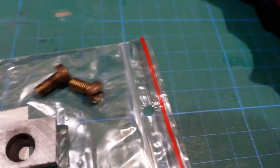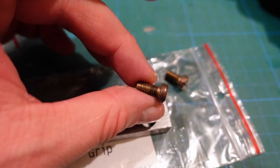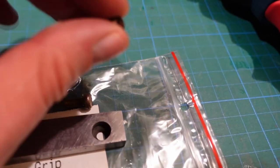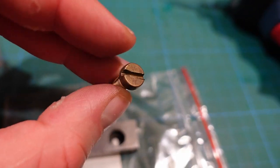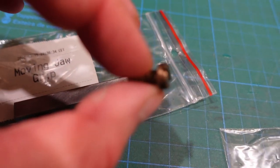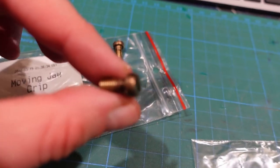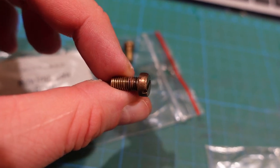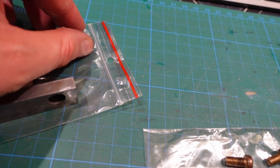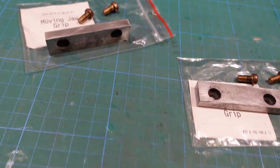And for the screws, you don't really see them. I didn't do any sanding on them, because what would you be sanding your screws for? You don't want to damage the threads. But they were in the same bath of this phosphate stuff. Phosphoric acid, yes. In any case, I'm pretty happy.